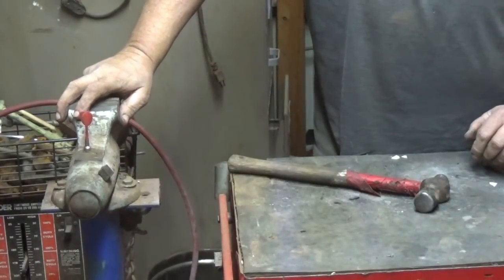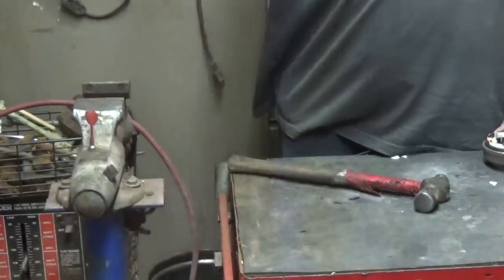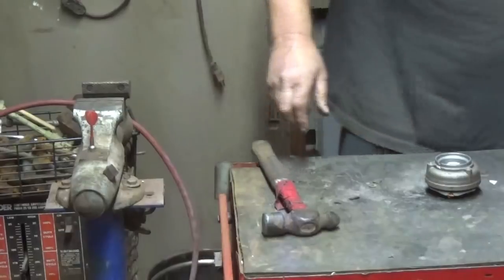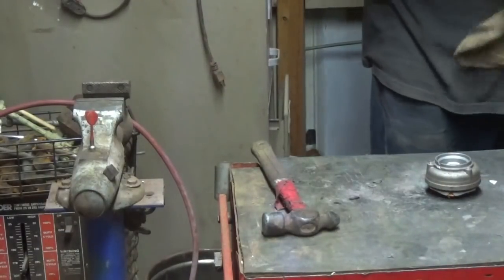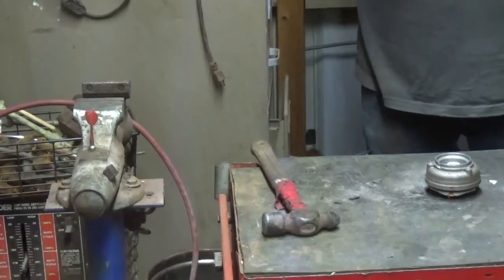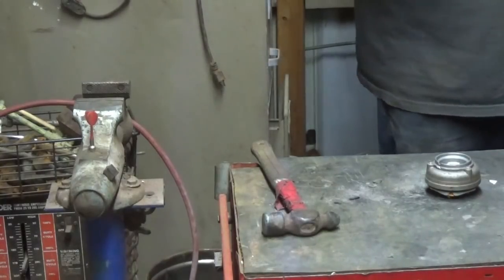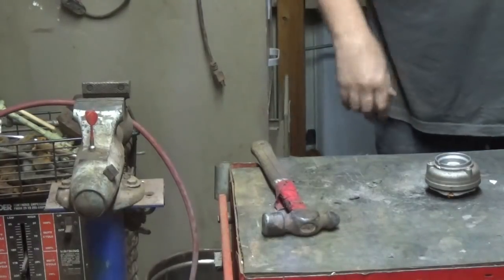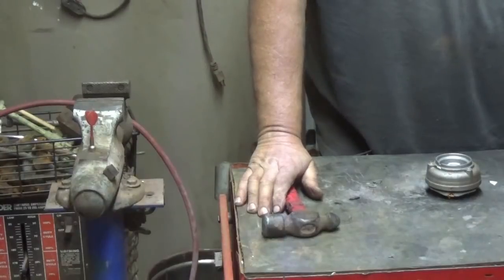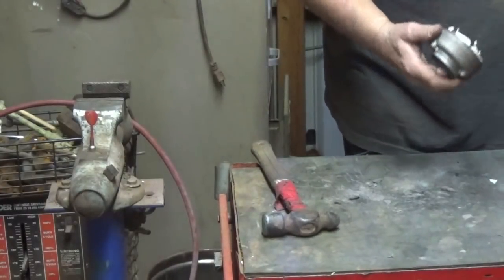But if I just went halfway down and then tried to foam in this wall here, the bottom, and that area there, and then built me a wall about halfway through, it'd be easy to heat this area. It'll only be about half the size of what it is right now, like I said, and insulated. Using the spray foam should stop a lot of the drafts. It really probably wouldn't hurt to spray foam the eBay room either, this 8x16 building, especially if the north wind's blowing, because it's to the north.